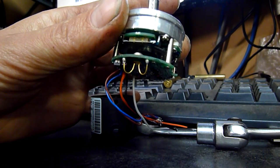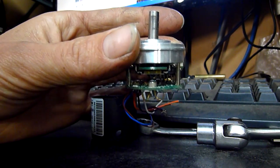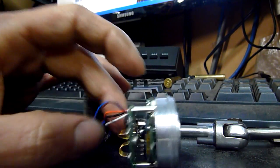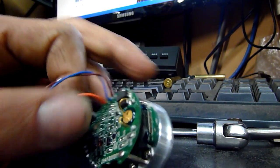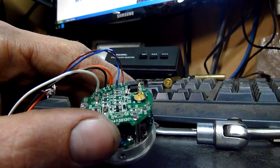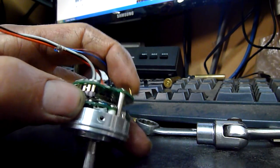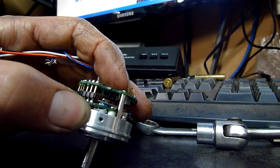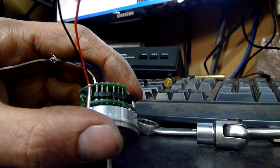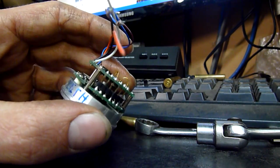I have put power to this, and even though it's damaged, you can't see visible light coming from it. If I had something which would detect infrared, that'd be another ball game — I'd be willing to bet that it's infrared. I cannot detect anything from that little diode there. It looks gold plated too; it could also be laser — infrared laser or ultraviolet maybe — but I'd be willing to bet it's just straight infrared. There is a fairly hefty little semiconductor under there. You can see a bit of thermal compound tape wedged between the front housing and the device. Oh, it's an 8-pin integrated circuit — you can see the pins underneath there. Probably a voltage regulator or something.